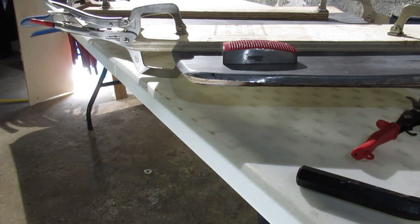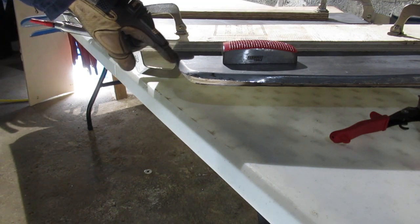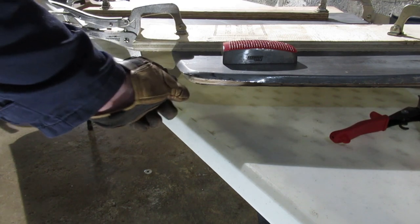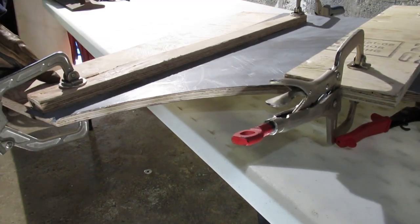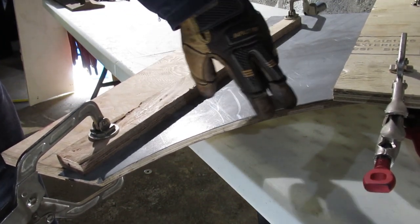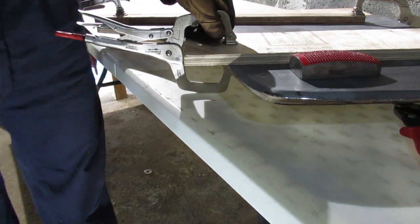We're making some pretty good progress and I'm starting to like the slapping spoon — you can hit with quite a bit more force than the other hammer. I'm just trying to knock over this corner, but this is where you start having to shrink. I've got to flip this over and make the outer radius come in, so I've got to keep beating the tucks back and forth. When I go around this corner the contour is on the opposite side of the circle, so here I just have to stretch it, and stretching I find is quite a bit easier.